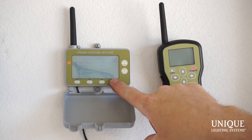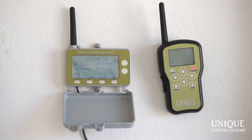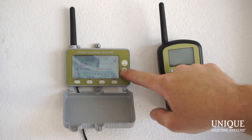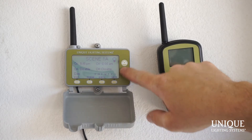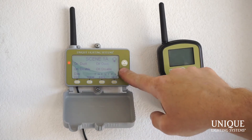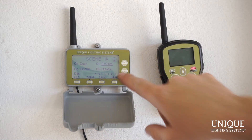This client has requested that the lights come on at dusk and off at 11 PM. The LightLogic is astronomical — it keeps track of daylight savings time, so the dusk and dawn features are a really great feature. Using the up and down button you can scroll from dusk to dawn or choose any specific time, or disable it. So let's go to on at dusk, hit next, off at 11 PM.